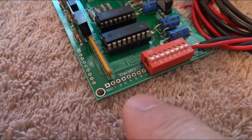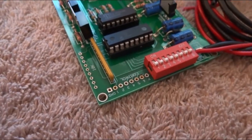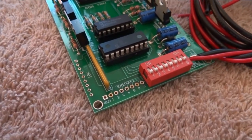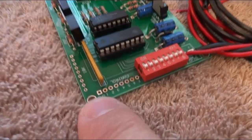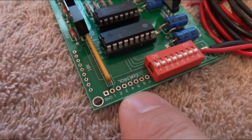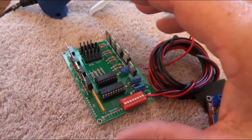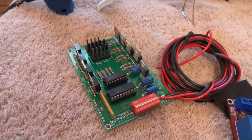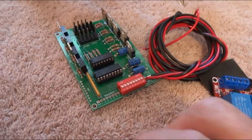Those will be hooked into the load side of this relay, and this will handle two of those holes — one hole on one side and one hole on the other. These are for light effects. The main one we're going to talk about today is the power pack pull, where everything goes dark. If you ground the ground pin — the little square pin — to pin number five, it'll make this board shut down slowly, like it's being robbed of power. Really cool effect.